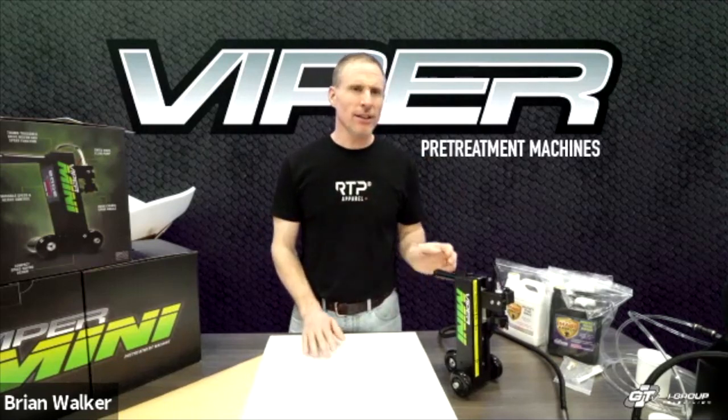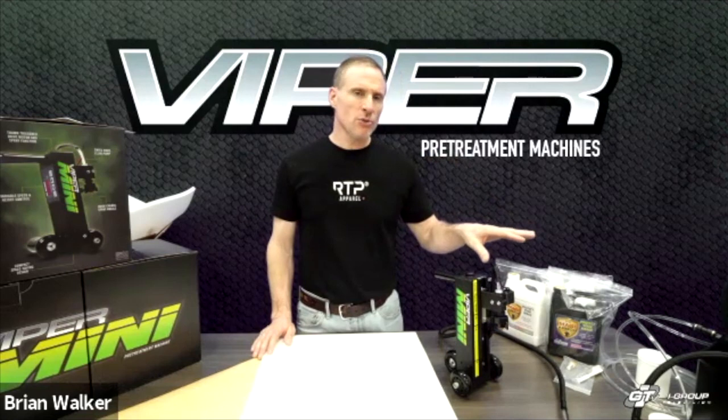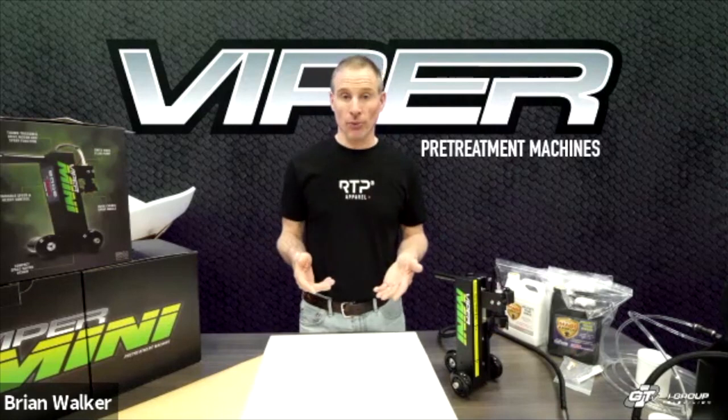People also ask about ventilation. I would not spray pre-treat in an enclosed, sealed-off bedroom, or even do your direct-to-garment printing in a sealed bedroom. Just because when you heat press a shirt, you're also getting dye and chemical burn off from that shirt. And anybody that has done any screen printing knows that when you run shirts through a conveyor dryer, it's just burning stuff off those shirts left and right. Well, you have the same issue with heat presses.